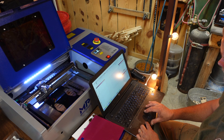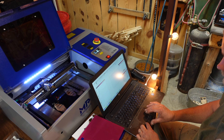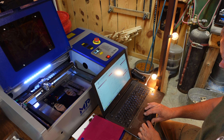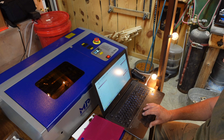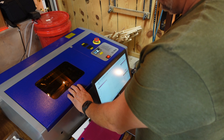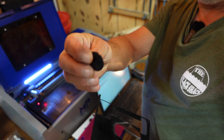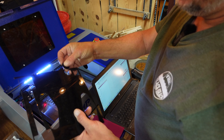These sheets here — you've seen these in my other videos. You've got the colors I can cut with a diode, and then the ones I can't: the dark blue, white, and pink were failed attempts with the diode. Green, red, and black cut with the diode. The orange I could not cut with the diode — but look right there, this CO2 machine just destroys this stuff. Let me play with a little piece of black first — I'm just going to show you how easy black is for this thing.